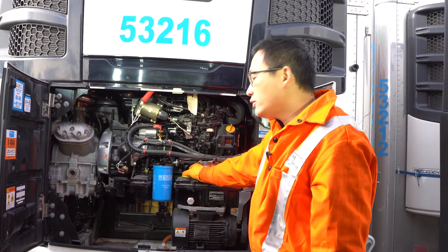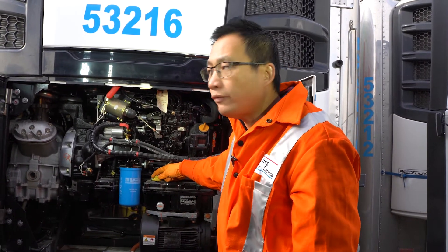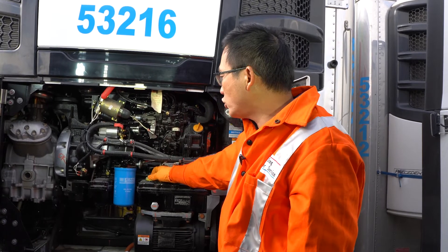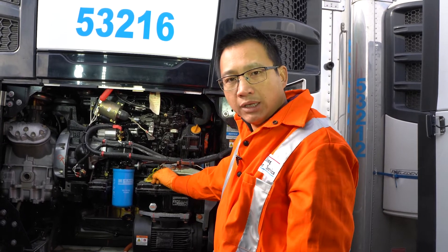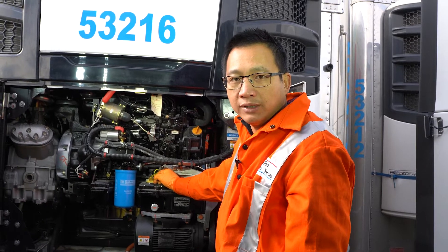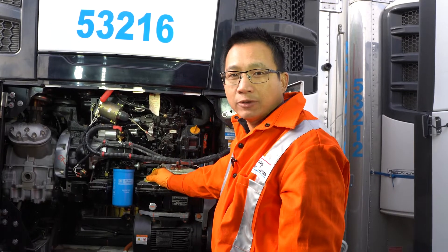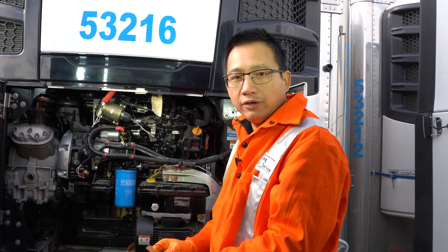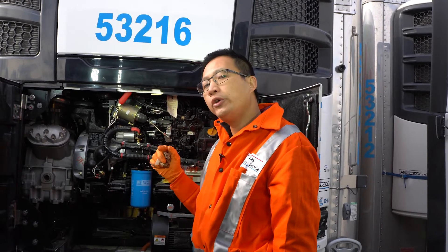10W30 — why do we use this oil only? We cannot share the same oil with the truck. Because Canada is cold, we have to make sure the oil is good for cold weather. If the oil is too thick or sticky, sometimes the unit cannot start by itself in winter. Nobody is watching the unit outside the truck — we have a driver inside — so we have to pick the right oil for the unit.